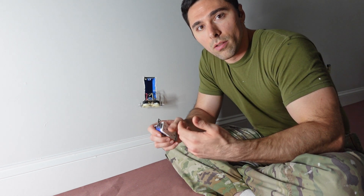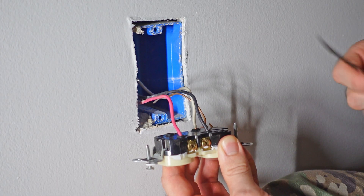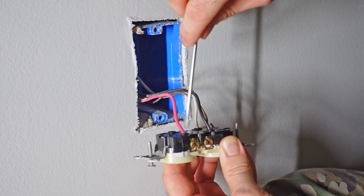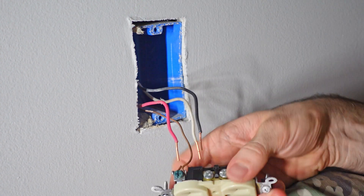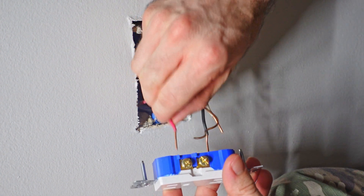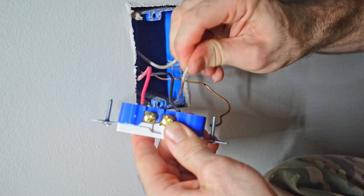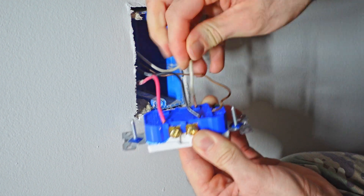That's also an option if you want the whole receptacle controlled by a switch, or if you don't want the switch involved at all anymore. Since I'm going to leave my receptacles as switched with the bottom part having constant power, I'm simply doing a one-for-one replacement — removing my wires and reattaching them to the new receptacle in the exact same spots. For the neutral wire it doesn't matter which terminal I attach it to, since you don't break the terminal on that side.